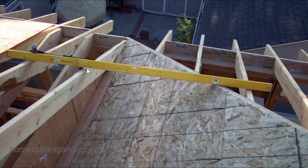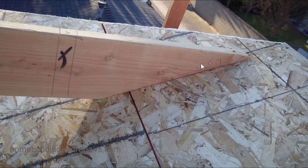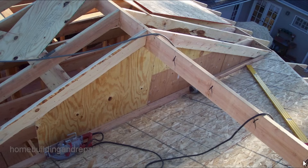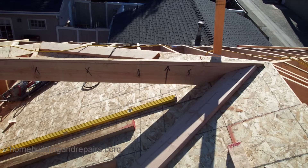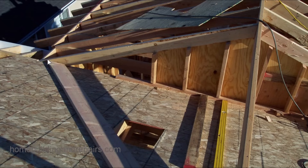You can see here we have our straight edge but there's a little dip. It's sticking up a little bit — I may have needed to take a little more off. If you have a dip, you can always add nailers to the sides to raise them up. If that doesn't work, you might have to move the rafters. Here's the ridge cut with a couple of toenails. Whether I put a block underneath or not I'm not sure, but there are a couple of toenails on each side and maybe one down the center.